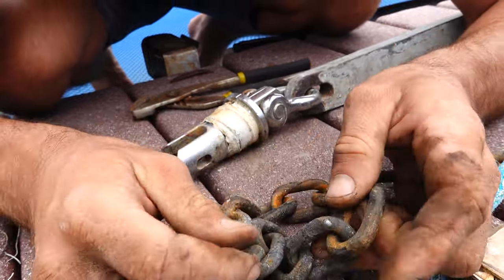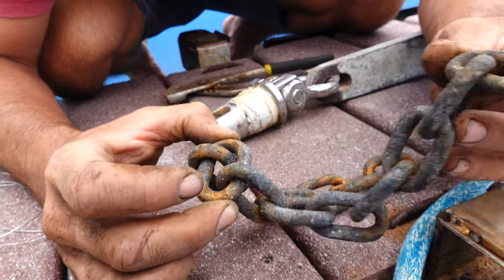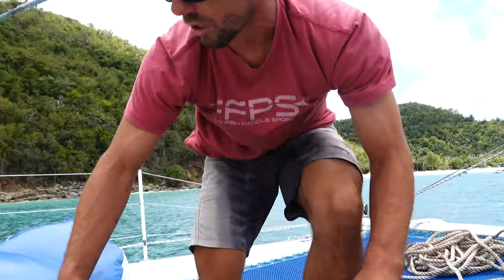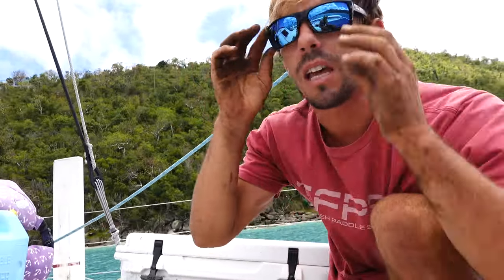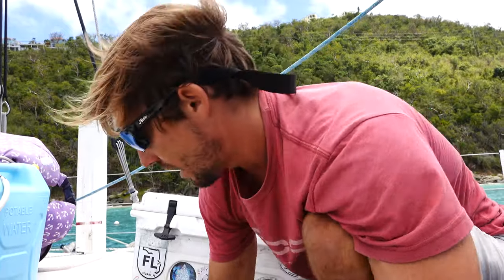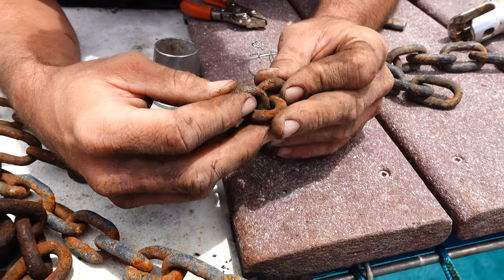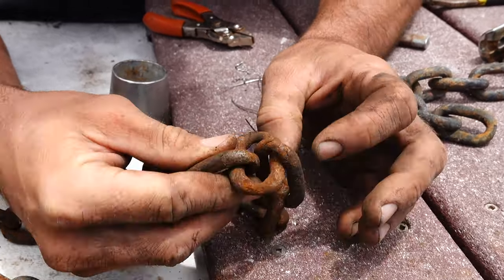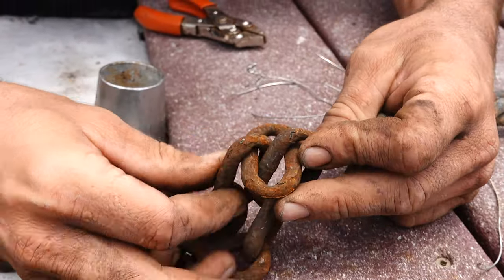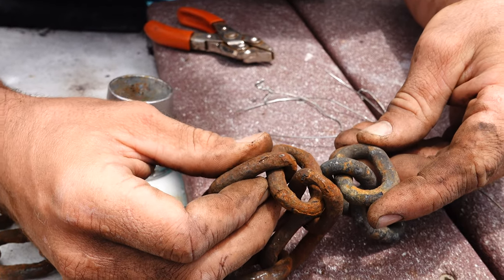It really doesn't look any more significant than the next second link up. Another link a bit further has slightly more diameter loss, but to be perfectly honest the limiting factor of this chain wasn't even those links constantly underwater — it was the links that are kind of always towards the top surface of the water, maybe coming in and out, around 50 to 70 feet up. Here's the worst of our chain, right around the 50 to 60 foot mark — quite a bit of diameter loss there.